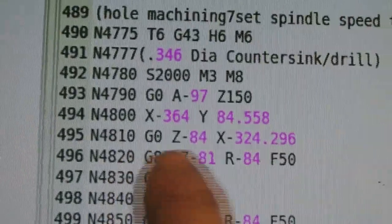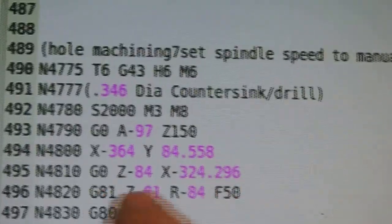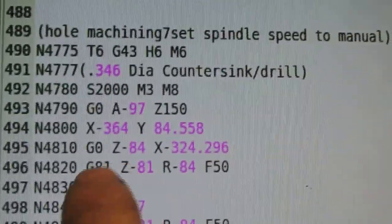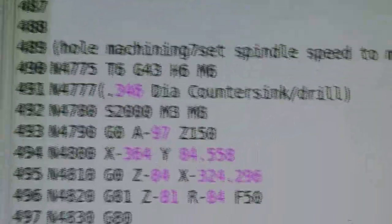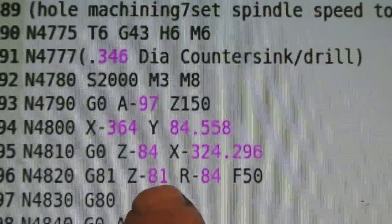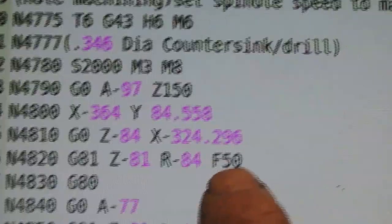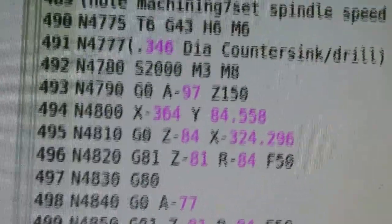This is the line of code that does the business. R is the start point, Z is the finish point. This is G81, a straight drilling programme. So you're telling it to go to Z81 from R84 — it's going to cut around 4.5 to 5mm. I can adjust this depth when I want to by going through the programme again later, but that's about the right amount. The F is just indicating to do that at a feed of 50mm per minute — very slow, but the drill is a homemade countersink, so I'm not too sure how well it's going to do.